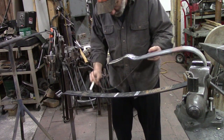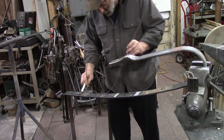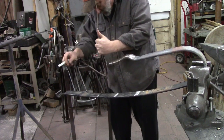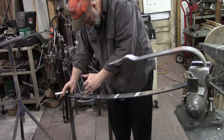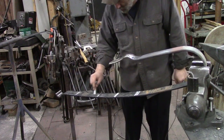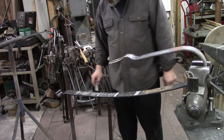And we'll roll this wire, he says. Line the marks back up. Roll the wire until it's the center, so I can mark the center of the bend, and then roll back to where it's flat. We can kind of mark where the bend will stop. So somewhere in those marks here, somewhere in here, that's where we need to be bending. So that's where we need to get hot.